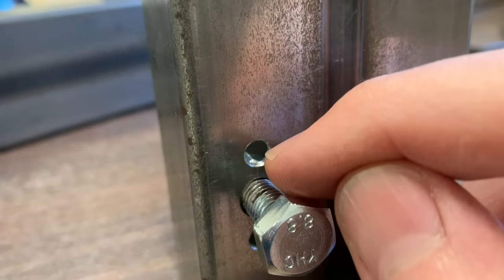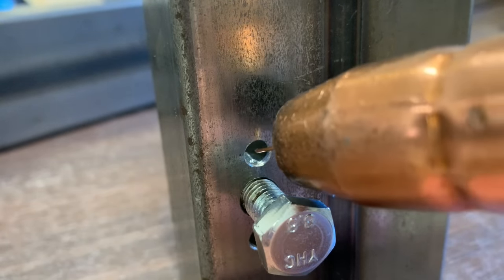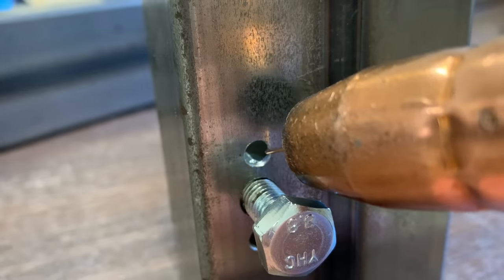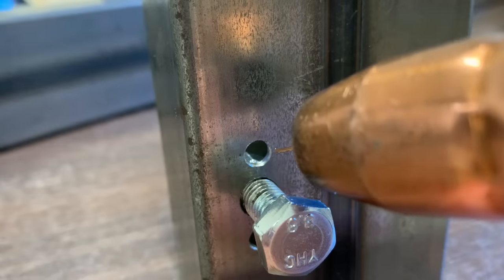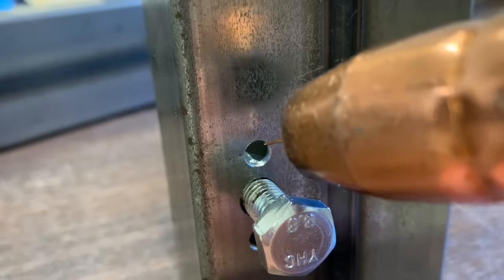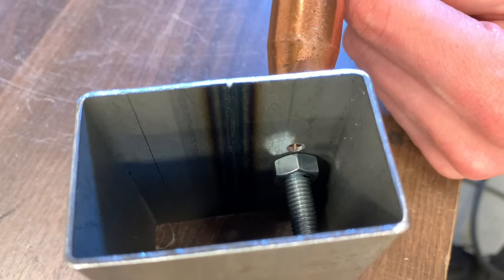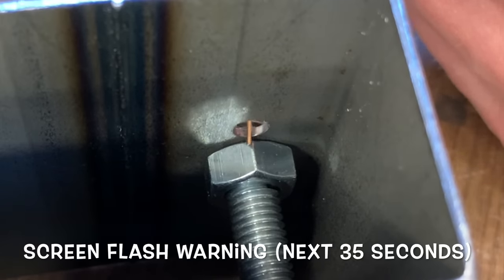I'm just using the end of the bolt to push off the opposite wall of the tube. Using a longer bolt or threaded rod could be helpful because you could more easily check that it's square. You can just see the corner of the nut inside the hole. What we're going to do is take our wire welder and aim it through the hole and pile weld on top of that nut. You don't want the wire to touch the side of the hole or you'll just weld the hole shut rather than welding the nut in place. Aim through the hole, weld on the nut, and as you build up the pile on the nut, slowly back up and fill in the hole with weld.